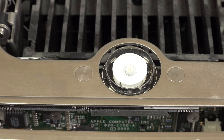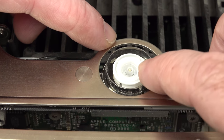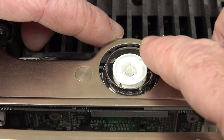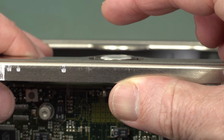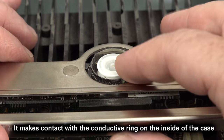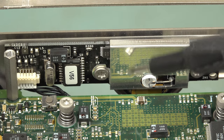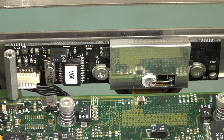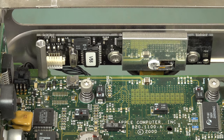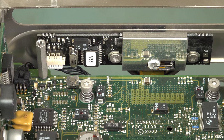One of the most remarkable things in this is the capacitive touch sensor on the top. They've got a little inner plastic thing that's holding the power lead in there, and a metal ring going around the outside. So presumably they're sensing the proximity of your finger, but it's got to go through the case - your finger is going to be a fair height above it. That's probably why they need that large ring around there. And there's the board for it with a big metal shielded can around it - lots of sensitive stuff under that. They've gone to a lot of effort with that board just for a capacitive touch sense button. It looks like it took 56 versions of the firmware in that microcontroller to get it right.